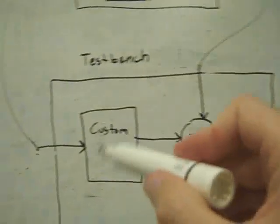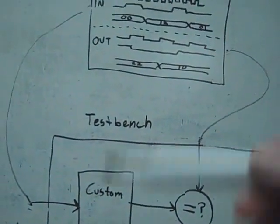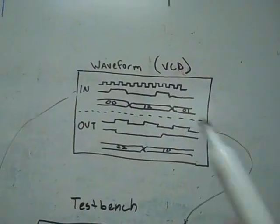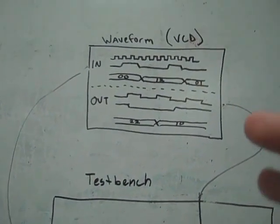The outputs get compared to what's coming out of my custom. I can let this churn and run through my whole waveform, and the comparator will tell me whether the signals are lining up or are off. Then I just go back into my Verilog file, tweak a few things, run it again, and see how close I am — basically keep doing that until it's an exact match to the waveform. That is probably the bulk of the benefit.